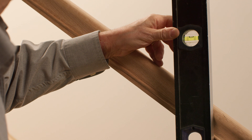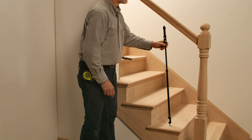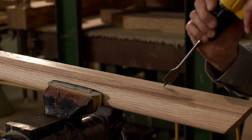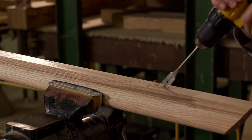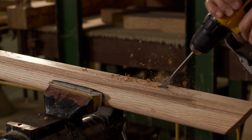There are two ways to do this: using a four foot level or using our baluster telescoping marking tool. Remove the handrail from the stair and drill an appropriate diameter hole one and a half inches deep at each baluster location on the handrail bottom.